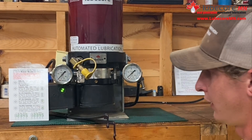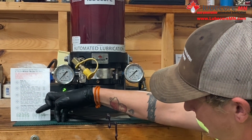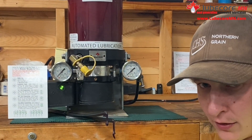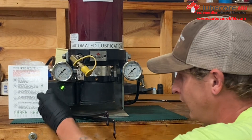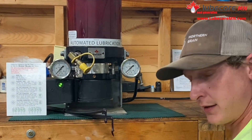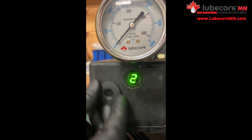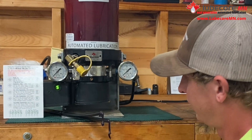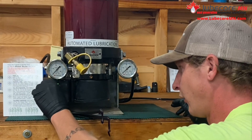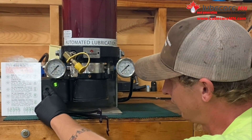Now we're at the four bars. As we can see, it was set to two, which means every 30 minutes the pump will go to the on time. Now let's say I want four hours in between each cycle — I'd go to the number five setting for 240 minutes. The same thing applies as the on time: you can either tap or wave, and then you can set the magnet on and it'll automatically save your programming.